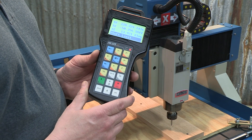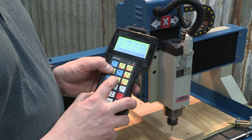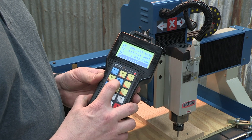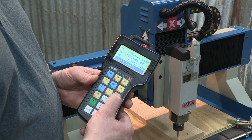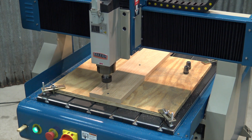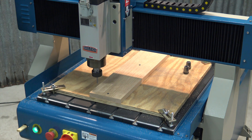Now we're going to do some manual cuts using the manual operations. First we'll move our spindle into position off to the side of the material, then bring our Z height down and start the spindle. This is a good way to test your feeds and speeds on the material and tool you're going to use before you actually cut the program. We'll turn the spindle on and very carefully plunge into the material, then move the gantry manually, then shut the spindle off and raise our Z height up. This gives us a good feel for whether we're cutting at the right speed and helps us understand the operation of the machine.